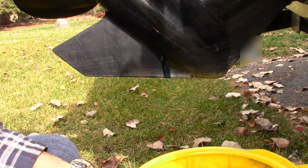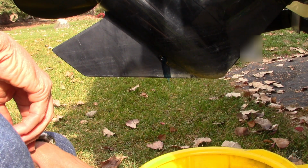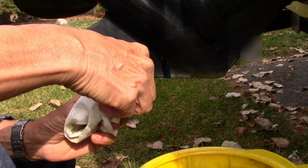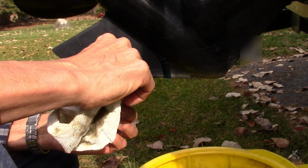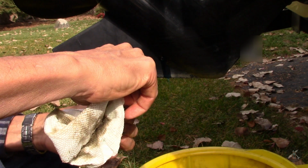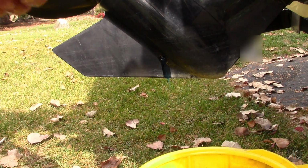One of the things you want to watch for as this starts to drain is whether it has water in it, or whether it's foamy. Because if it's leaking, water in the oil isn't a good lubricant, and you can end up with a mess. End up with a mess means damaging the gears, damaging the bearings.